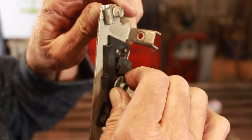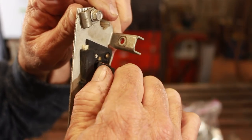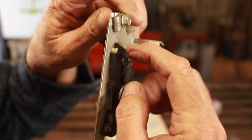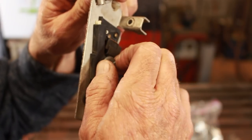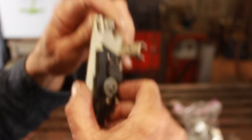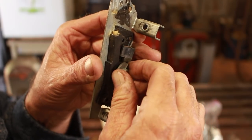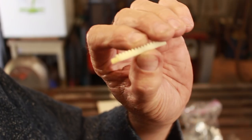This time I'm lucky enough to actually have an example of the part that's broken. If you take a look right here, there's a rack gear in there and this pinion drives that rack gear. What happens is the rack gear pulls on a cable. You can see on this one the end broke off and it was made in nylon. But there was enough extra meat there that they got in and drilled an extra hole and were able to keep this one going. Unfortunately on this one they did that once and then it broke too. This is the white rack gear made of nylon.